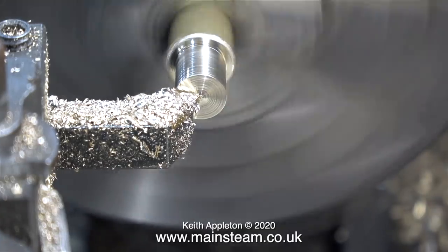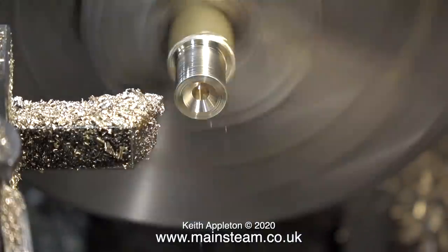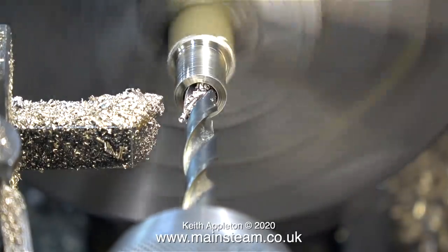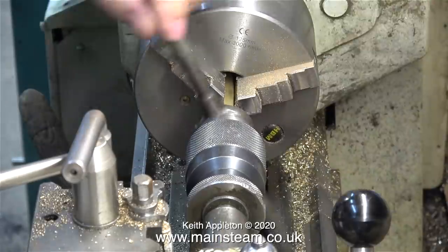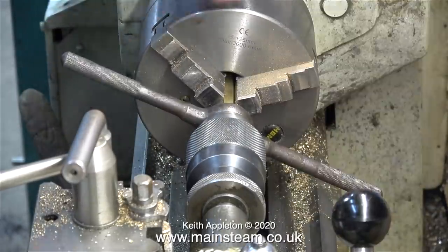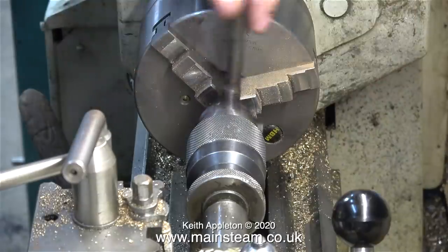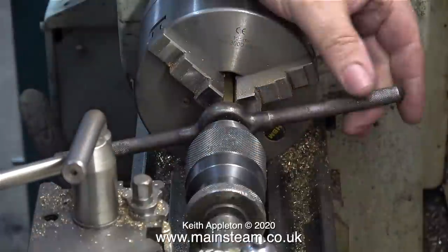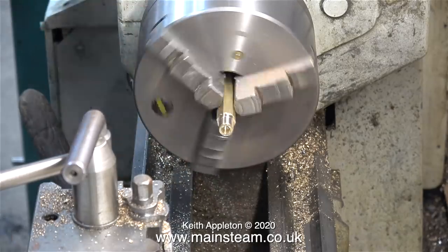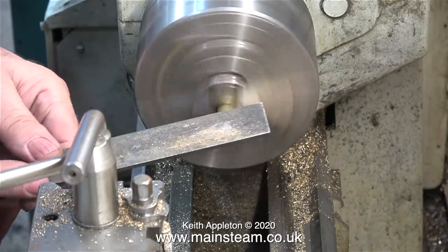Recently I did a job on an engine where I needed to change the check valve, and it was completely corroded away because it had been leaking — the leak had never been rectified, and the combination of limescale, oxygen, and water corroded the fitting very badly in just under two years. The sequence you're watching I do very frequently, so I don't narrate it in detail. Here I'm threading the part using my tailstock die holder substitute — a standard hand die holder — keeping everything square with the tailstock fitted with a chuck. This thread is unusually 3/8 by 40 threads per inch.